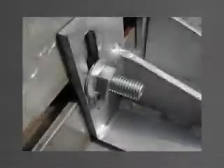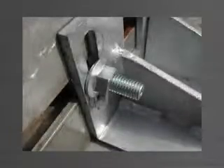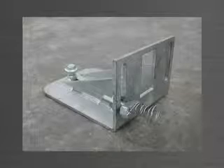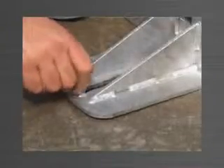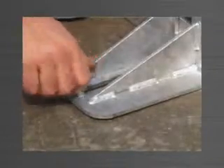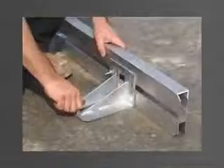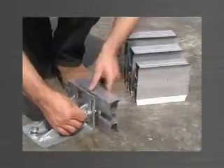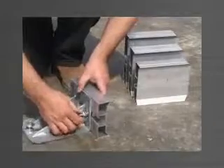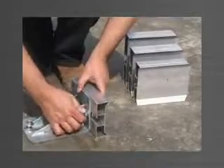Note that the stud bolt is only required on one of the two vertical slots and can remain attached to the top bracket when not in use. The tilt adjuster raises the back of the bracket, causing the edge form to tilt until plumb. This feature is not required often, but is still provided as an option. As with all Panel-Wear brackets, the top bracket will accommodate all four sizes of edge form.